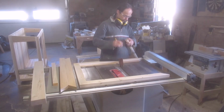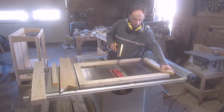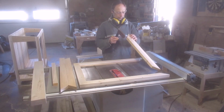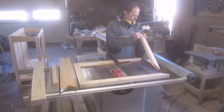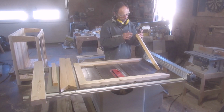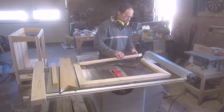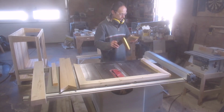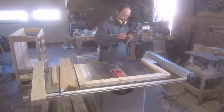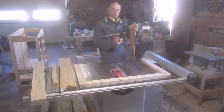So what I'm doing here is I'm going an inch from the inner portion and scribing a line so I know on what trajectory to put my dowel. An inch from the inner side. And that dowel does one thing. It lines up the piece, the screw will be the clamp, and the strength of the material is going to come from that glue joint with the dowel. Now, if the glue joint ever fails, the dowel is still glued in there. So that's an extra piece of strength to keep everything tied in together, right?